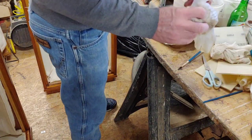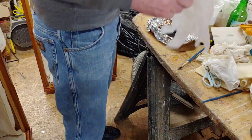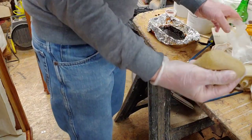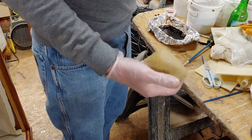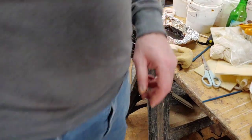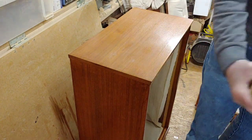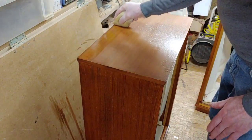So we need to grab our mop again, our rubber, I should say. This is what's called an open rubber at the moment. Some people call it an open fad. I'm just using it as stockinette, like so, and afterwards I'll be putting an old hospital sheet wrapped around it to get a smoother finish at the very end. So we're going to dip our rubber in the polish a few times to load it up, right? And now we're going to start mopping it on the surface.